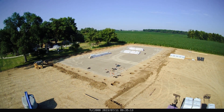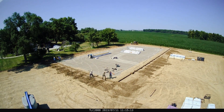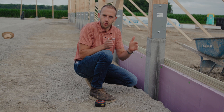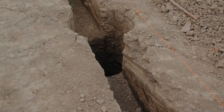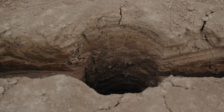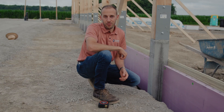We then actually trench through all of those holes with a trench that's 10 to 12 inches wide, somewhere in that range, whatever you feel comfortable with, that's 24 inches deep. Then we come back and drill the holes again. What that allows for is to have a nice trench where you'll have your two-inch foam, and then it'll allow you to have your holes drilled so you can set your post in there.